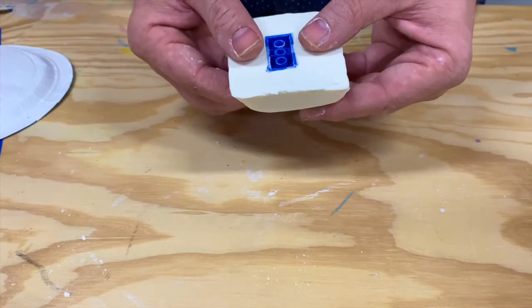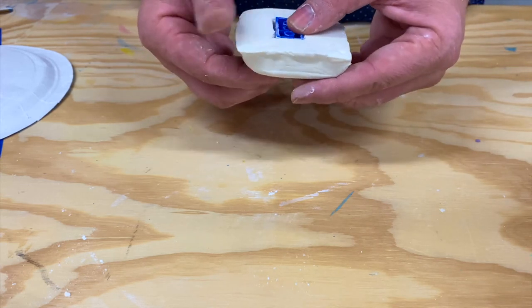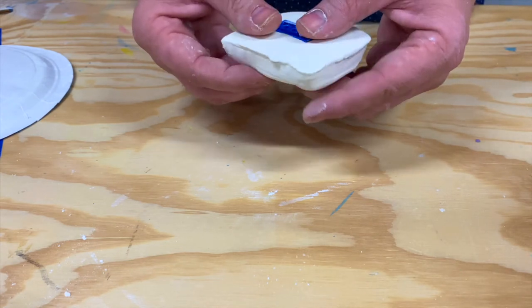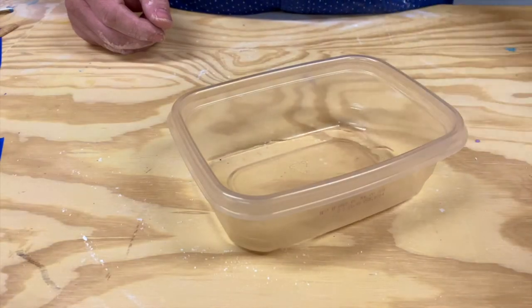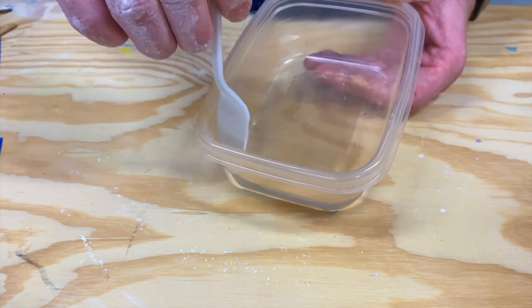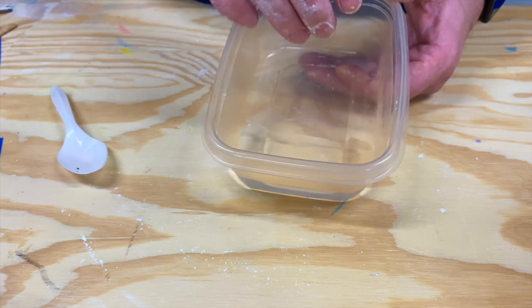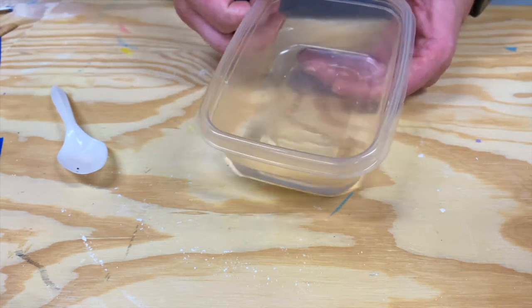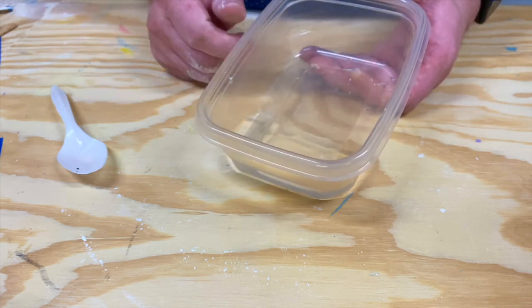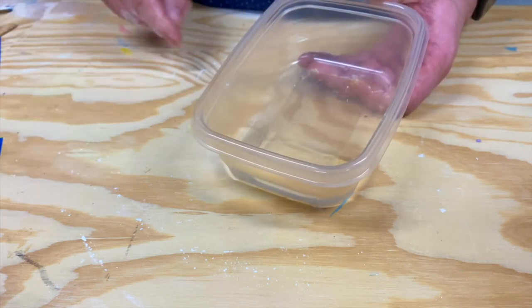It's been about 20 minutes — really probably about 15. It doesn't take long at all. You just want to gently pry around those edges. So the way to mix plaster: there is a scientific ratio you can use, but the general rule of thumb is that as you mix it in a circular cup container, when you start to see a mountain in the middle that is not a floating mountain but a solid mountain all the way through the plaster, then you know you've got about enough. I'll show you another way to test it when we get it mixed up.